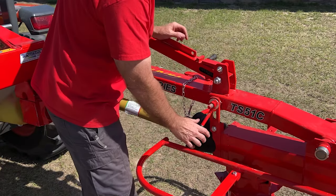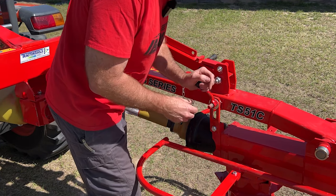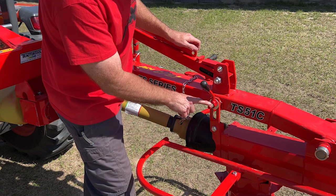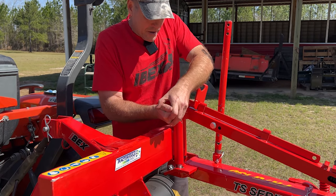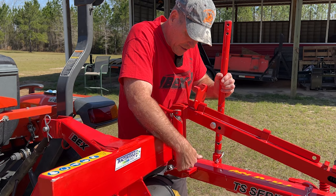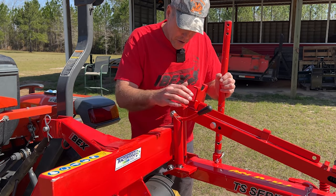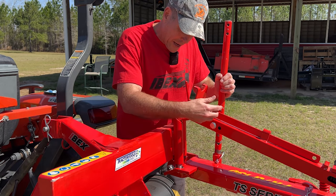On this side of the mower you have this lever right here that's attached to a nut and you'll just tighten that — that doesn't allow these drums to move. You'll loosen this up in operation mode. The first lever we talked about is this lever right here and you pull this up and when you do it disengages from this hole right here and it allows the mower to swing. But in transport mode you want that down, and actually put a little bit of grease right here to make that easier to go up and down.